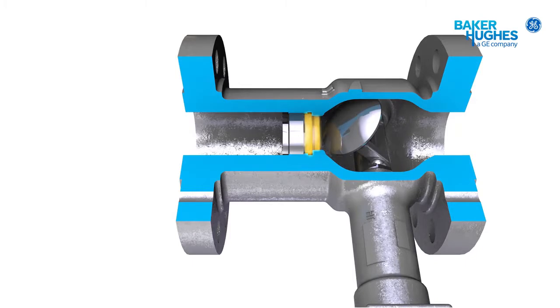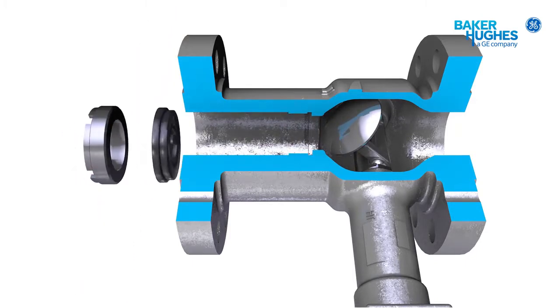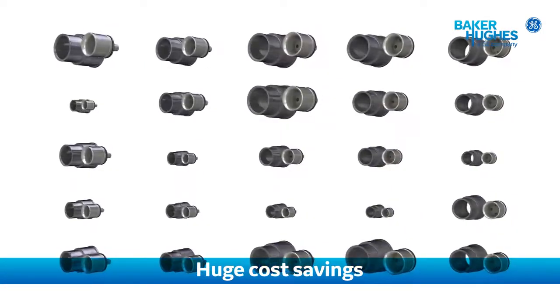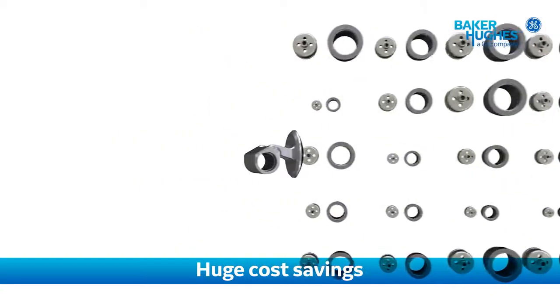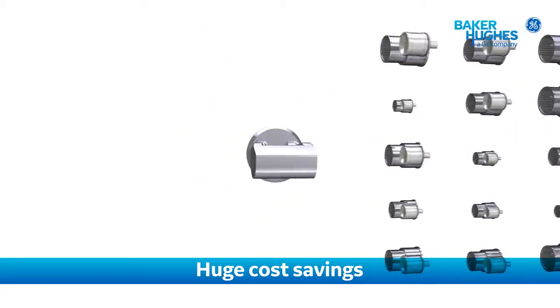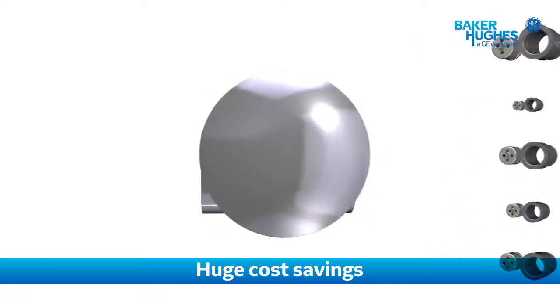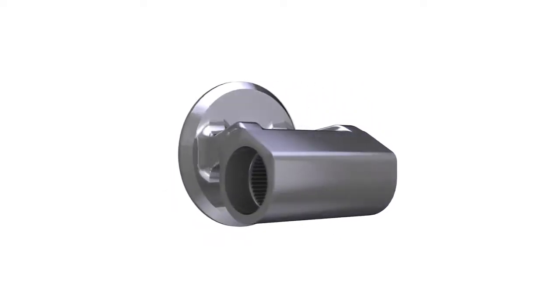Combined with a simpler design with less packing and no gaskets, this means fewer parts to stock and manage. If you have 25 reciprocating valves with different CVs, you're stocking 25 different plugs, cages, and seat rings. But with Camflex GR, you only need a single plug. In a plant with many valves, this adds up to real, tangible savings for the maintenance team.